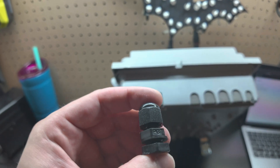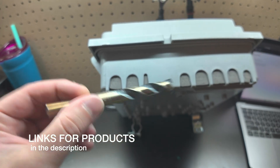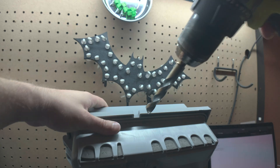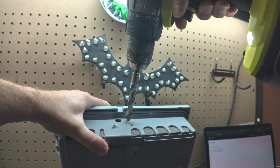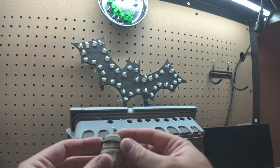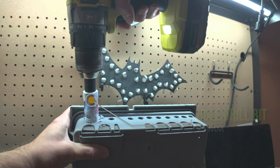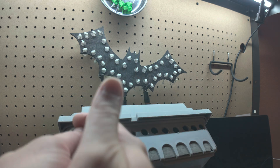For these particular glands, they're the PG-7s. I only need a half-inch drill bit for the eight or nine holes I need — this is the perfect size for these to screw into. Let's get these holes drilled. I have one final hole that's going to hold a half-inch gland for the power cable, and I'm going to put that hole on this side. With that last hole drilled, let's go ahead and get all of our adapters pushed through and tightened down.